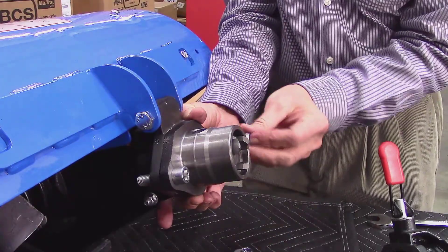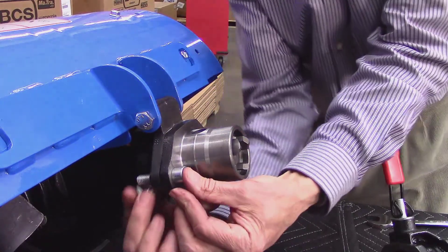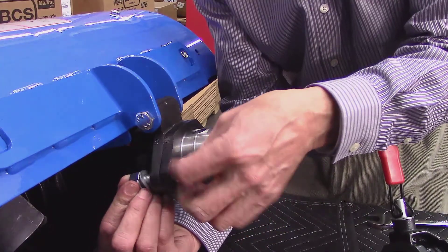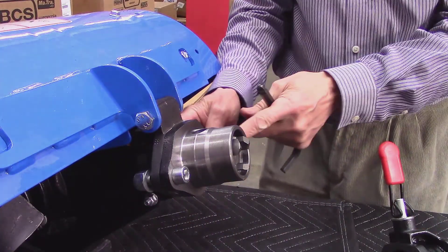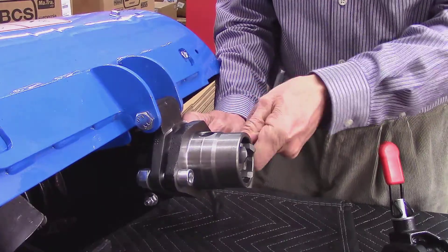Bolt the male tang to the attachment, making sure that the hole in the tang is pointing upwards, that the round head of each bolt is facing the tractor, and that the washer and nut are behind the flange of the attachment. Tighten each nut using your Allen and open end wrenches, but not completely — leave each one about a quarter revolution short of being fully tightened.